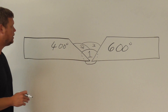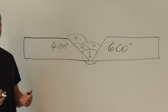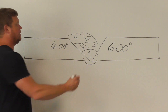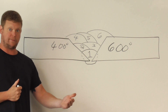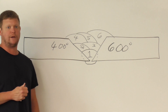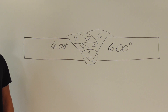So it can be a long process if you're doing a multi-pass weld like this — I'm assuming this is about a half-inch thick plate. Pass three: you hit it with a temp stick, it doesn't melt, so you go on to pass four. Keep testing for the interpass temperature to make sure it's below 300. Once it's below 300 again, do pass five, then wait until it's below 300 again and do pass six. Then you go into your mechanical testing. Get a pass done, wait until it's below the interpass temperature, do your next pass. If you're doing a weld test like this, have something else going on — because you've got to wait, and welders tend to not be patient. You cannot rush it.